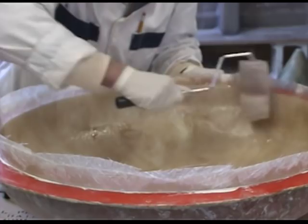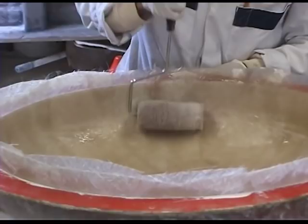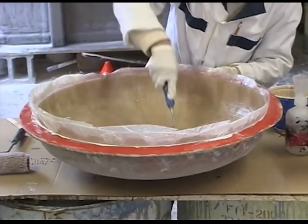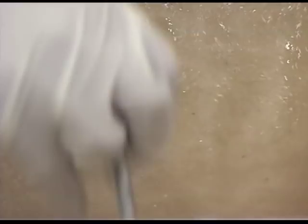We're now about 4 or 5 minutes into the laminate here, and the binder in the mat has had a chance to break down, and we're working the air bubbles out here. In the final touch-up, Bernie's going to run over the laminate here with a bristle roller. Again, these are great. They'll form themselves actually to the surface of this concave edge. You can see the resin coming to the surface there. That's what you're looking for, that nice little gloss, little droplets of resin.